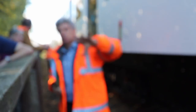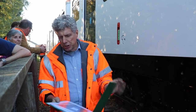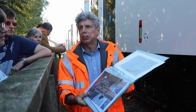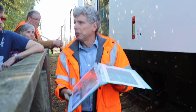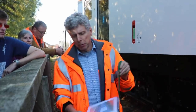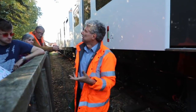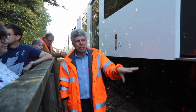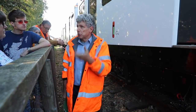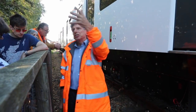These batteries can only accept a certain charge rate — we're limited by what we can push through the cable. With bigger batteries, we're looking at putting the old London Underground collector shoes back on, picking up current from a third rail. The problem with those is there's a limit to the current you can push through iron-on-iron contact — it's effectively a brilliant welding set. So there's a limit, and you also have to keep the batteries cool, which is part of the next-generation development work.